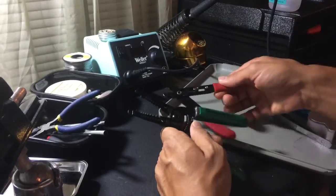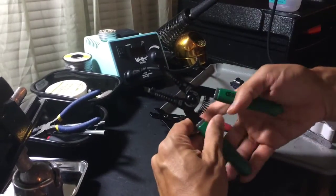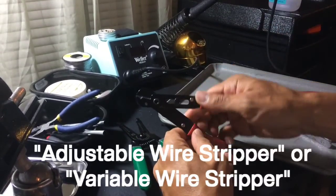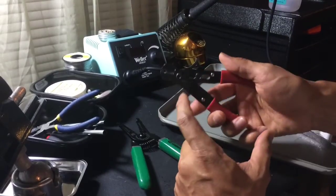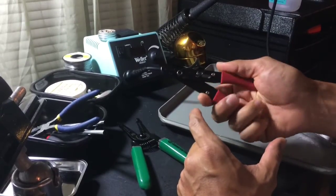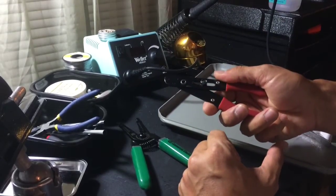You'll need some wire strippers. I have two here that I like to use. This is a general purpose wire stripper with various gauges and a pair of pliers in the front. I like this one to cut small wires — it's variable so you can move it up and down to vary the width it strips at. Since I like to use it for small wires, I usually leave it at this setting.